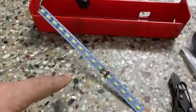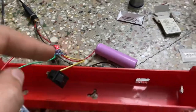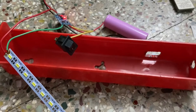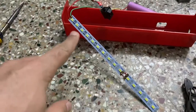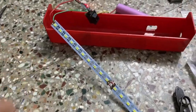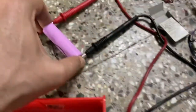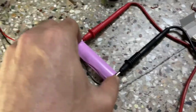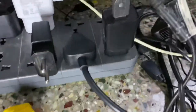When the charger is switched off, the voltage is exactly 3.7 volts, which can still drive the LEDs. All connections are working fine. I'm testing the battery voltage, which reads 4.05 volts — this happens because a lithium-ion battery specified at 3.7V will read higher when charged. The lantern is self-powered by the lithium-ion battery.